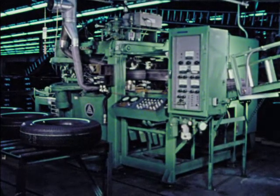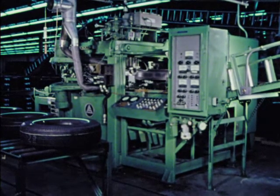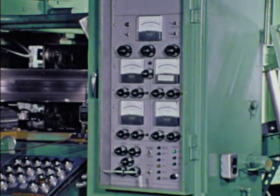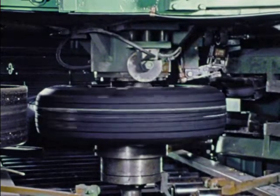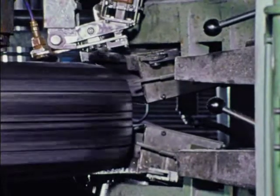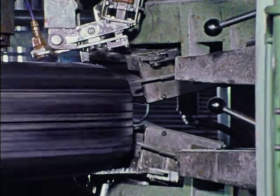After a dozen inspections and precision balancing, there is yet another step: calibration, the ultimate test for uniformity, for tiny internal force variations adversely affecting tire ride and performance. This is the tire uniformity machine — a computerized electromechanical marvel, 10 years in development by General Tire engineers. It automatically, right on the production line, detects tiny radial force variations, pinpoints their location, and makes the necessary corrections. It goes a long way toward solving the age-old problem of vibration in tires.